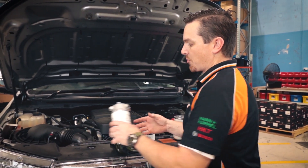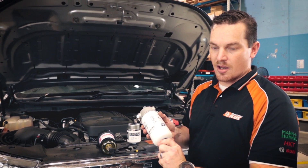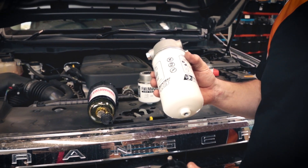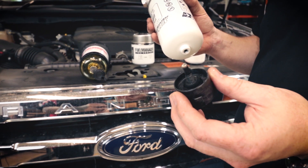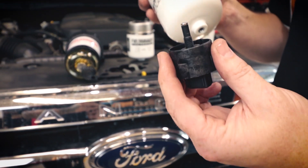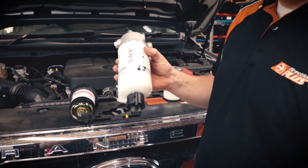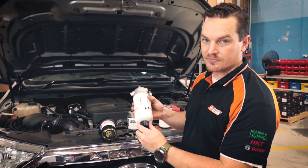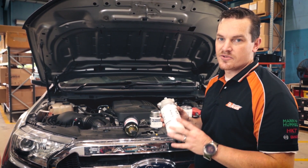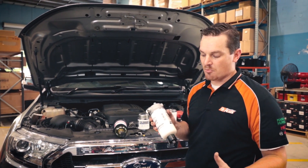With the pre-line it's a little bit more advanced — you don't actually have to visually check it. You can't see what's going on inside, and because you can't see, we have a water sensor at the bottom. This sensor measures the resistance difference between fuel and water, so as soon as water reaches the height of the sensor it will notify you straight away. Same principle as the fuel manager: as soon as the alarm goes off in the cab, three quarters of a turn, count to ten, and do it back up again. The ideal thing is you don't have to keep checking it — the alarm will let you know straight away. If the alarm keeps repeating, you obviously need to keep draining as you've picked up a whole heap of water.